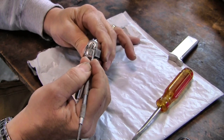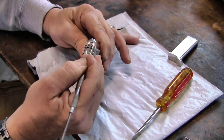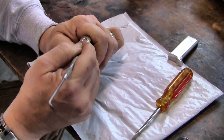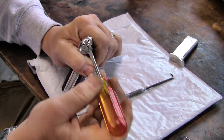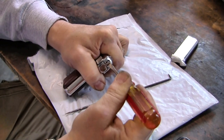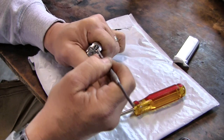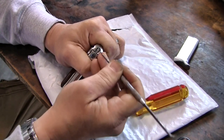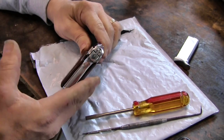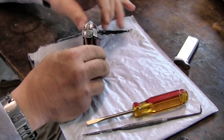What is different is that plug is split and goes across something. I'll try to depress it here, but with my hand it's very difficult. You'd either have to get a thin screwdriver blade and go alongside and depress it — or with a machinist punch, depress it like that. Then, keeping pressure on it, you would have to pull the slide back and lift up. I can't do it on the table, so I'm going to have to go to a vise, put this in a padded vise, try to depress that, and ease this off.